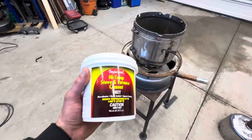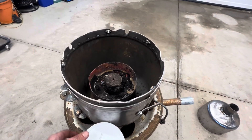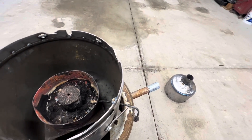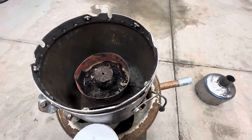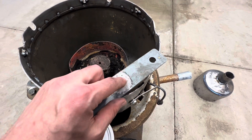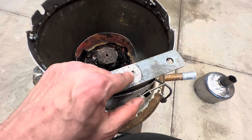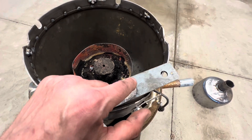My plan is to use this refractory cement — this high temperature stove and furnace cement — to line the interior of the combustion chamber, both bottom and top half, so that we can focus more heat energy into the actual combustion chamber and direct it across the heat exchanger rather than having it radiate out the sides. I've done some testing: applying refractory cement to bare steel doesn't have great adhesion, but if you rough up the surface with a grinder, it sticks really well — so well that I was hitting it with a hammer to try and knock it loose and it had bonded quite well to the ground steel.